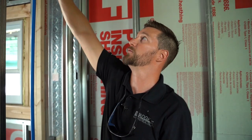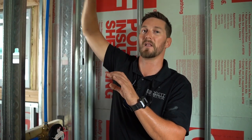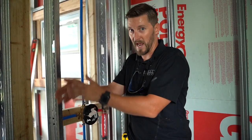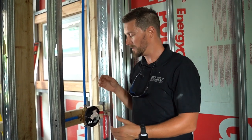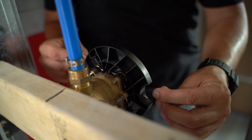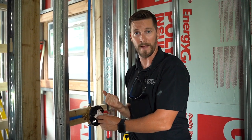When you do that, just put some pipe tape and even pipe dope on top of that, and then it will thread in. You won't be able to see this fitting when the drywall is up — there'll just be a hole because this will sit flush or behind inside the wall. So make sure when you're doing that blind, you get that thing sealed really well. Get it nice and tight, but not too tight. For each individual valve, depending on if you're putting drywall — it would be green board, don't use regular drywall, you have to have mold resistant drywall. Durock is going to be your next best bet. In our case we have a prefab fiberglass shell going in. Your valve doesn't always just sit on a 2x4 like this, but you've got to read the instructions to see how far back that valve mounts, taking into consideration drywall, Durock, thinset, tile, whatever it is you're putting there — add all those together so your valve isn't too far back or too far forward.